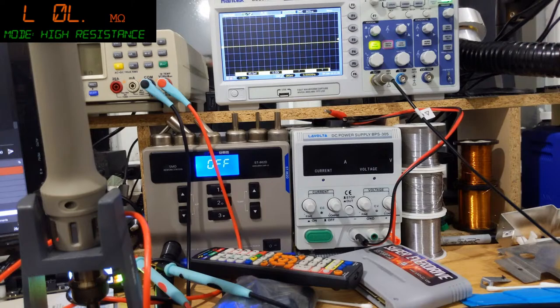I'd be curious as to if this drive could actually be fixed. I don't think that it really can, because I think the laser diode has gone. I think what's happening is it's trying to read the table of contents of the disc and it can't do it, so it just doesn't do anything. But I'm surprised I'm not seeing anything at all as it tries to do that. We get that initial spin and then nothing. What I was hoping to see is the peak to peak of the laser reader, but I can't even see it.